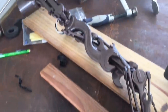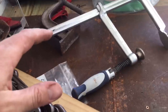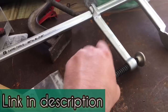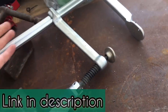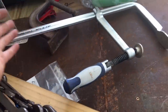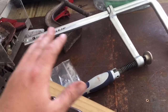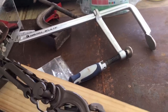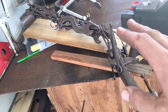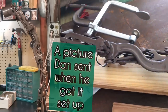These are the older ratchets — cheap ones I found — so sometimes they can be hard to adjust, but it's not impossible. The bottom one is actually a quick release. The base piece has the C-clamp with just a piece of pipe welded around it — I notched out the pipe to the C-clamp. The little ratchet sits inside, then the middle section goes into that ratchet, and the top section goes into the other one. I also want to mention the Capri Tool welding clamps — these performed awesome, serious clamping power, very beefy. I leave them outside near the coast and they haven't rusted yet. I'd highly recommend these Capri welding clamps. Dan, I hope you like it — it's coming your way.